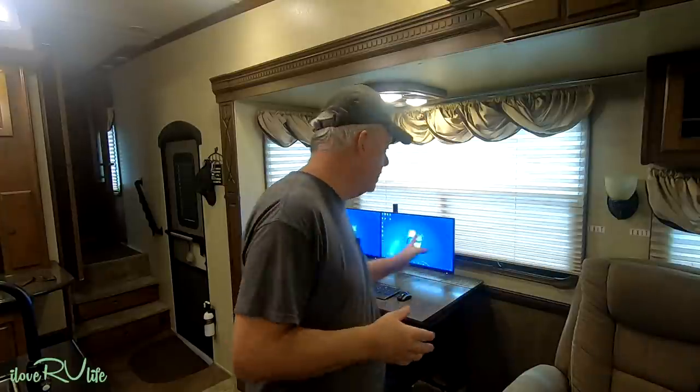Well, this has turned out to be a great project. Time-wise, it probably took right at about 6 days to do this, 5 to 6 days. Probably about 2-ish, 3-ish to be able to build it, cut it, put it all together. And these weren't 8-hour days by any stretch of the imagination. But what really took so much time was staining, letting it dry for a day, polyurethane, let it dry for a day, sand, another coat of polyurethane, let it dry another day. That's what really took so much time, was just going through the finishing process, not the actual build itself. But it's very substantial. Gosh, I just love this thing.